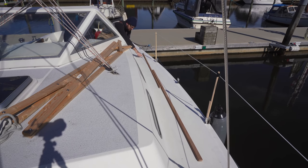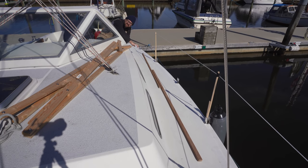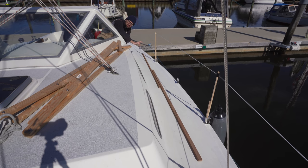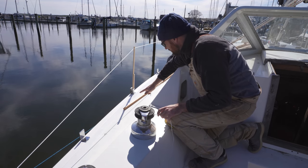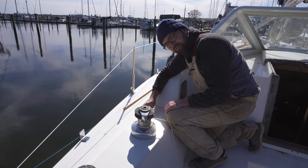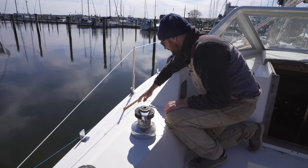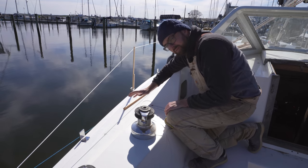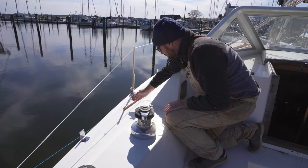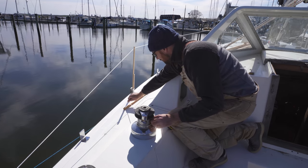This represents a 3 meter long track for the headsail. I don't think it actually needs to be that long, but I just want to make sure that I get it long enough. One of the other Warrior owners told me that they had some issues with chafe on the sheet for the tracks they fitted. The way they combated that was by putting a block in the toe rail. Of course, I can't really do that, so I just want to have the track long enough that I can put another car down here and run the sheet through that instead.